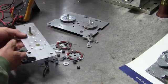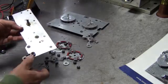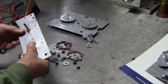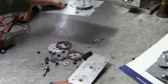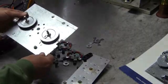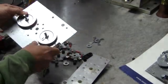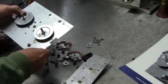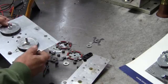So we're going to replace it with a new unit. This item number is 610364. It appears on the 6000 series — 6012, 6014 units. I'm going to show you a larger one. This is a plate that's used in the 6002, 6001s, and 6006 units, and this is number 610100. This is a larger plate and it has more diodes in it, but it acts the same way.